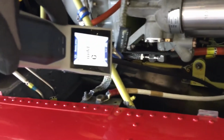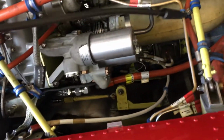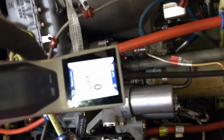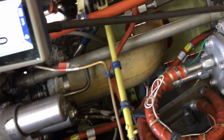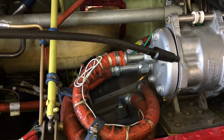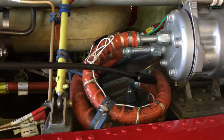Down low, we're in cloud hunting mode and I have time and I'm just looking for any beeps at all. Just get close. And there's dye in this system, so we'll look at it when I hit it with the dye, the leak detector too.